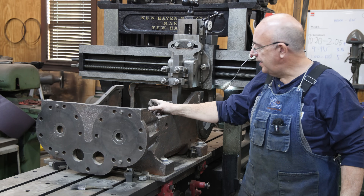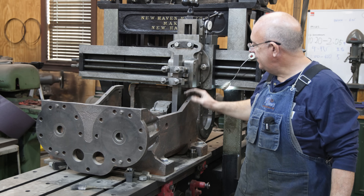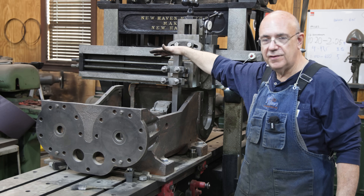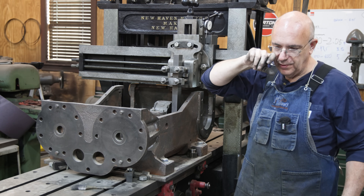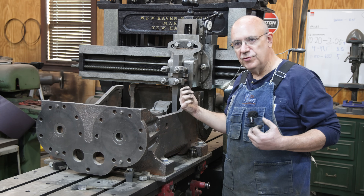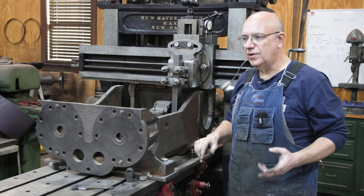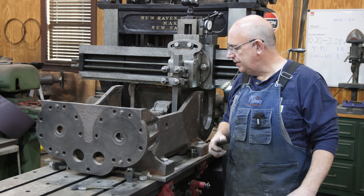Things are not going quite as I had hoped with this planing tool in the bottom — I was afraid it was going to be a little bit too wide, and with such a long outreach in here, it's just not working. I've got in mind a different type of tool holder — a little bit different approach — but it's going to require me making another tool. I'm still working things out in my head, but that's probably going to be an upcoming video: making a long-reach tool holder to get down into the bottom of the hole. In the meantime, I can go ahead and rough out the other side off camera.